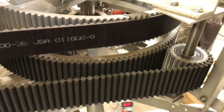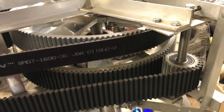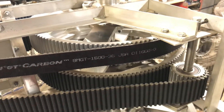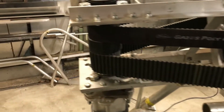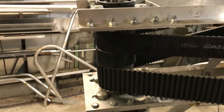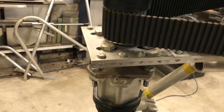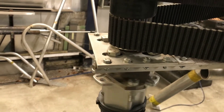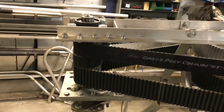Coming down to the belt, you can see how it reverses the drive — one belt runs on the back side of one pulley, the other belt runs on the front side, so they turn in opposite directions. The primary drive pulley has four sprag bearings — one-way bearings — so it can allow the drive shaft to rotate separately from the rotor if the engine were to suddenly stop, letting the rotors continue spinning for a while.